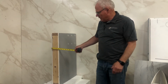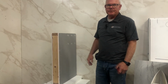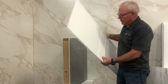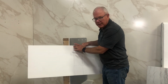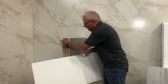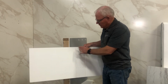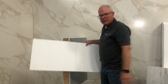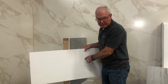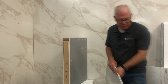So most walls are 4.5 inches. That's with framing and wallboard. And so if you've got 4.5 inches, what you're going to want to do is put V's 5 inches from center to center. So you've got 4.5 inches and add 1/2 inch. So center to center is 5 inches, so that when that is wrapped, the inside measurement is at 4.5, and we'll wrap this post perfectly.